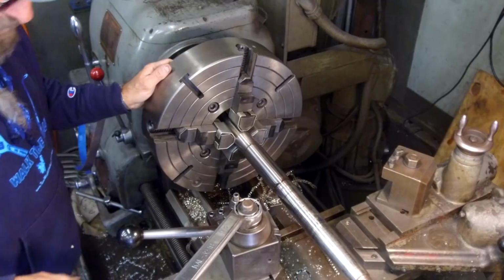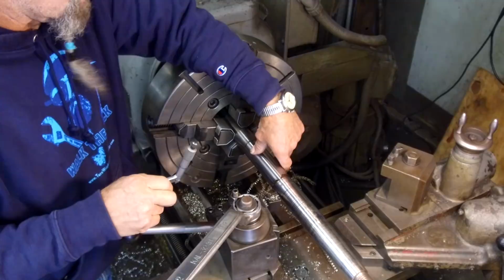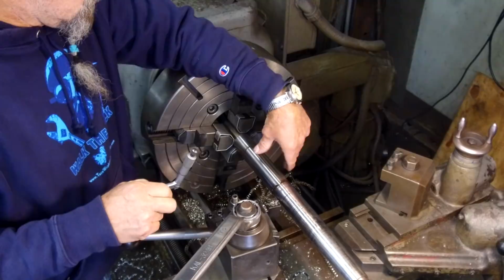And in the yards, we did do a lot of flame spraying. We used to do ceramic flame spray on bearing and packing areas on patrol boats for the Navy. That was the only flame spray that we actually did. Some of the plug valves and other things that we were called out to flame spray and then remachine failed hydro tests because it's a porous material and it would leak. So not all flame spray is ideal for all situations.